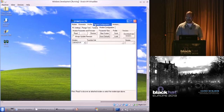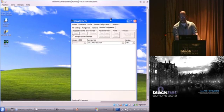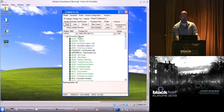And in terms of setting it up, I click on modem configuration. I read the configuration. And now it's telling me, okay, here's the channel, the PAN ID. Again, this is the default, 3332. If you want 1337 or something else. And this device has a destination low of 1. My address, the 16-bit low part of the address, is 0. Which honestly, if I'm using API mode, doesn't really matter. And again, for the Series 2 in particular, you have to make sure that this says whatever you want. This one just says Xbee Pro. It doesn't have a lot of other options.